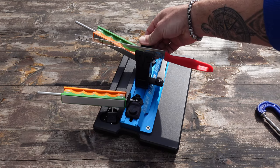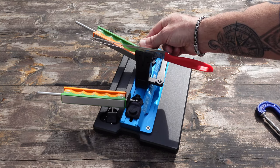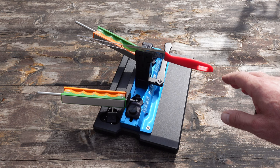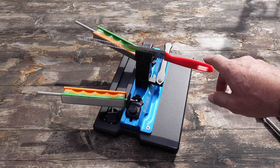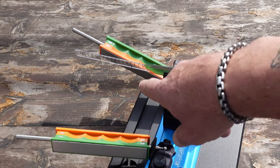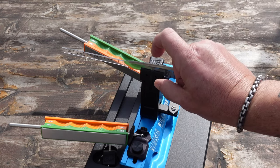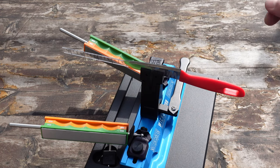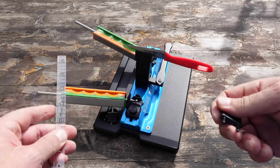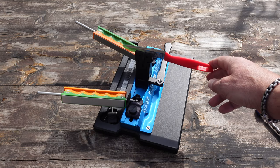I'm using my alignment tool and the depth key here for demonstration purposes. I've already sharpened this trainer blade before, so I know the right angle and where to find the sweet spot. With the alignment guide it's very simple — just make sure the tip is flush with B. The depth key gives me the proper depth since this is less than a one-inch blade in height. For more detail on the sharpening process, check out my other videos linked in the description below.